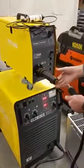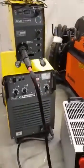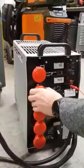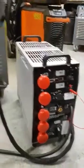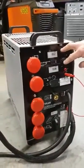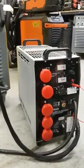We have these as an optional accessory and there's a little switch on there to energize the power source. On the MIG machine we energize the power source — you can see a no-load voltage displaying on the Calibrator, two decimal places on volts and one decimal place on amps as normal. You can see the values and compare them to the power source and carry out the calibrations. The accuracy levels on this exceed every known standard requirement, so you can work to the highest precision grade to IEC 60974-14 and every other international standard we're aware of.